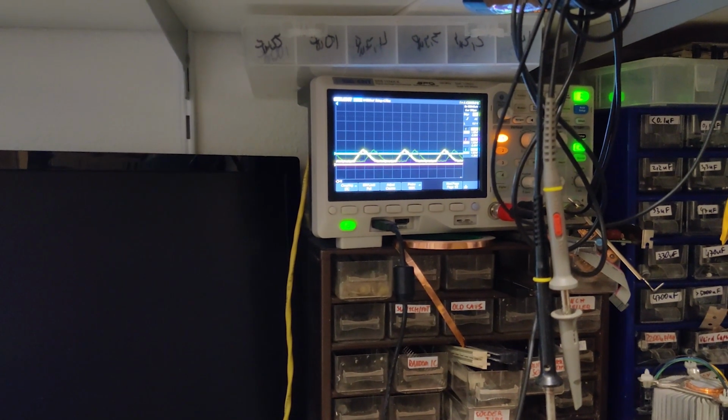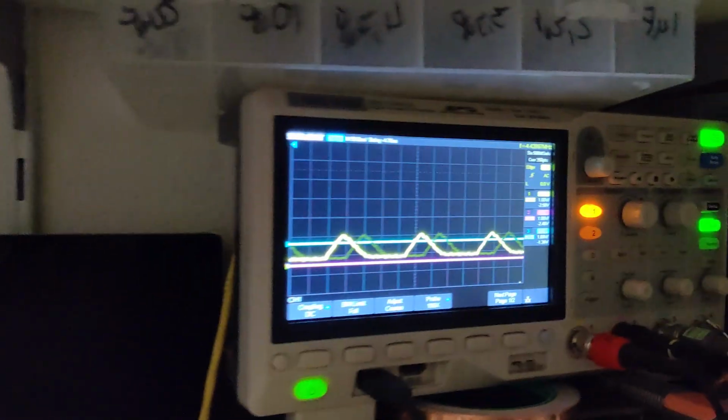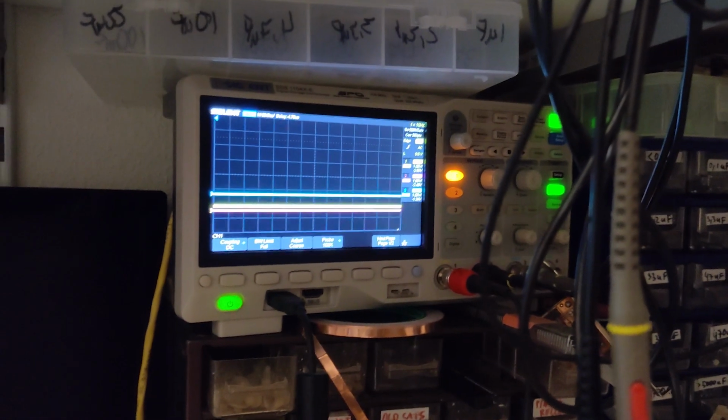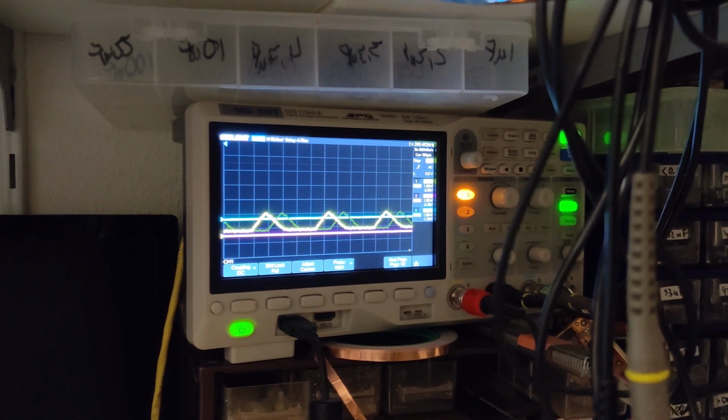So, what we have right here is what's supposed to be the composite video signal. Does this look like video to you? Sure doesn't to me. Actually, this kind of explains what we saw on screen, because I used a really cheap USB composite video capture dongle, and it just tries to display something if it receives anything on its video inputs. It just turns up the gain really high and tries to output whatever to the frame buffer. But let me just show you what happens when I power cycle it. It stays low, and then it slowly comes in at some point.